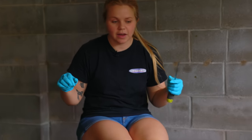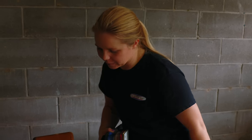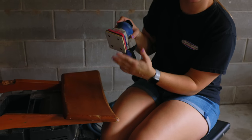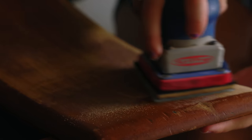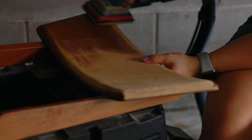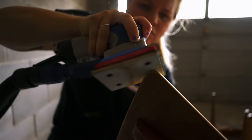Next, I am going to go ahead and break out my sander and see how tough this finish is. I need a mobile workbench, so I'm going to be on the lookout on Facebook Marketplace, but that's besides the point. I am going to get to sanding these. I've got my Surf Prep sander 3x4 here, connected to my dust extractor, which I'm also using as a temporary table. I've got 80-grit sandpaper because we are going to work on sanding through this finish. If it's kind of tough, I do have some stripper that I'm going to try, but I want to see how long it's going to take with the sander first.